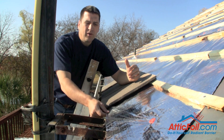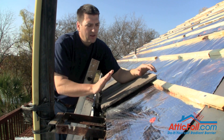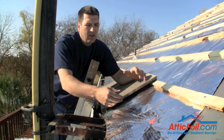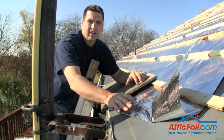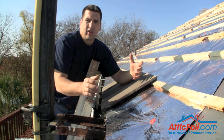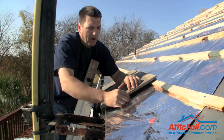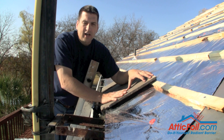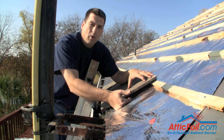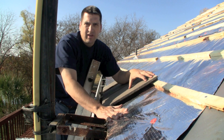I'm on the roof now, and I'm going to explain exactly how a radiant barrier installed under a tile roof helps to improve comfort and efficiency. This concrete tile roof could easily reach 150 or 180 degrees on a hot sunny day. The decking or the membrane behind it can easily reach 120 to 140 degrees because that heat is radiating across the space, being absorbed by the roof, and then ultimately traveling into the home. By installing attic foil radiant barrier on top of the membrane with this required air space, the tile is still going to get hot — it wants to radiate across that air space — but instead of being absorbed, we're reflecting over 97% of the radiant heat. The result is the membrane behind it is going to stay within a few degrees of ambient temperature.